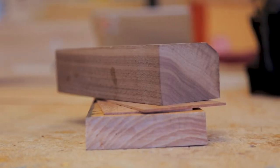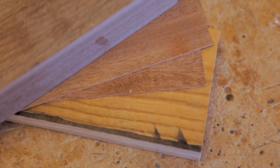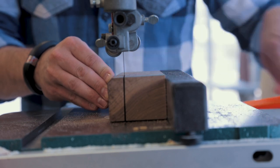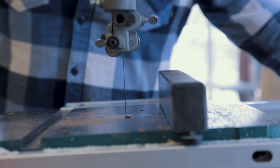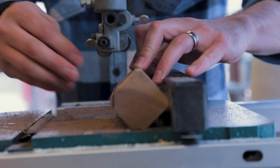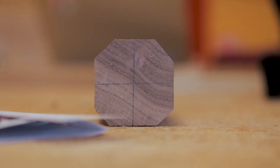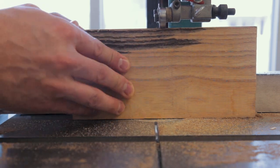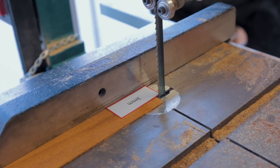I went and got some hardwood at Hobby Lobby. Yeah, I know — who knew Hobby Lobby sold hardwoods? But I came across them one day and picked up some cherry, some walnut, and some oak. I started by squaring off a block of the walnut and then cut the edges down to make it more circular, easier to start turning on the lathe. I cut my oak into thicker pieces for the base and the cherry pieces into strips.